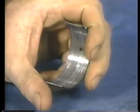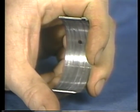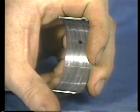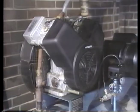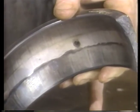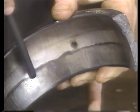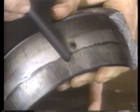Knocks and thumps in a plain bearing are an indication of looseness. With a reciprocating load, these will naturally be loud and easy to detect. This sound can also indicate too much play in a shaft. A high tone or whine often means a brinelled bearing. That is, a bearing where the rollers have permanently dented the races.